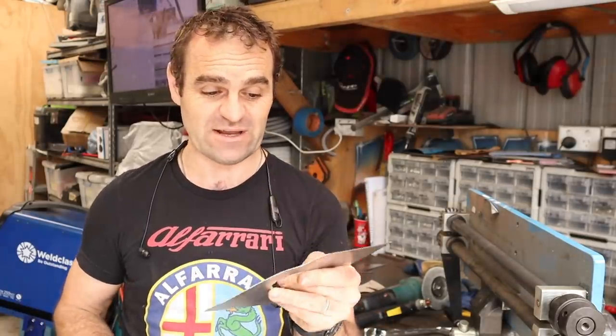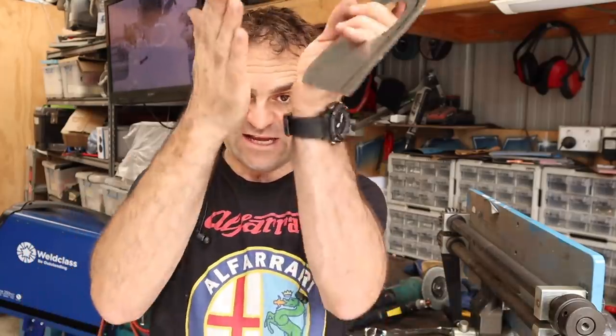I've been watching a bit of Make It Custom, another really good channel doing hot rod builds if you want to learn how to do sheet metal stuff. He's really informative on that. He uses the bead roller to tip the edge and get that crease started that you can work from. Now, I need to get some better rollers. At the moment, I've only got offset rollers on my bead roller, but having a sharp roller and then a rubber roller on the bottom will let you push a bead into a fold in a piece of sheet. I don't have that, but I'm going to make do with what I've got.